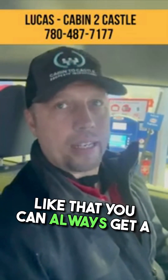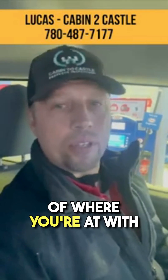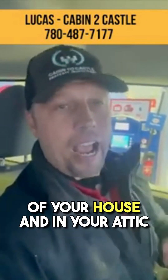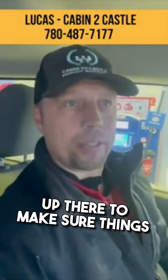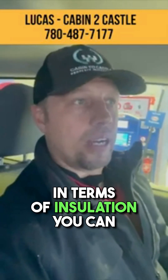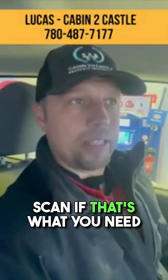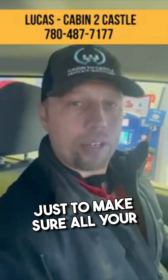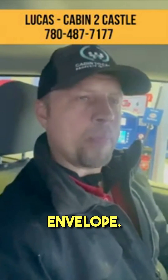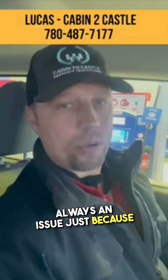In terms of insulation, you can always get a home inspection just to see where you're at with insulation around the perimeter of your house and in your attic. An inspector will poke his head up there to make sure things are looking good in terms of insulation. You can also get a thermal imaging scan just to make sure all your insulation is continuous throughout your building envelope. Another thing I always talk to homeowners about is fresh air — in the winter it's always an issue just because windows don't open typically.